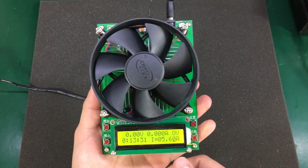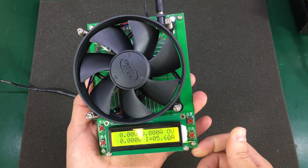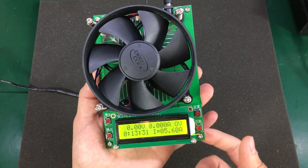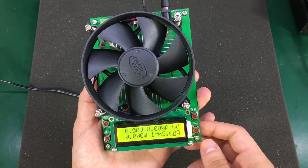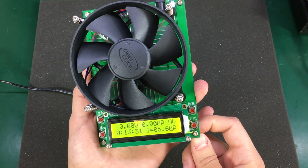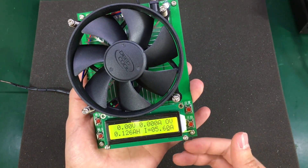The fan will start at 45 degrees Celsius and stop at 40 degrees Celsius — it's just on/off control, not variable speed. If the heatsink reaches 87°C it should start to reduce power, and at 91°C it cuts off with an over-temperature error. During my tests, I noticed there is actually no power reduction at 87°C — only a cutoff occurs when the temperature goes over 91°C. The fan does keep running until the unit has cooled down to 40°C.